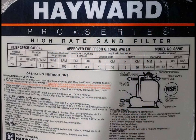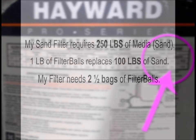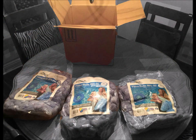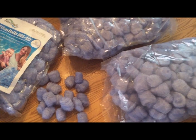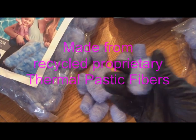This is the filter that I'm going to be replacing the sand on. If you look at the top under model number, media required is 250 pounds of sand. So if this sand filter requires 250 pounds of sand and one pound of filter balls replaces 100 pounds of sand, this filter needs two and a half bags of filter balls. Ordering the filter balls was easy and receiving them even easier — you know what I mean if you've ever had to haul sand around or pay extra for weight. As you can see they are small, firm, and they seem to hold their shape really well.